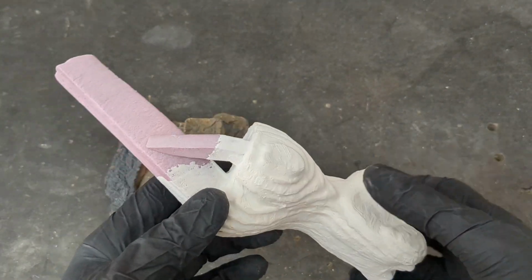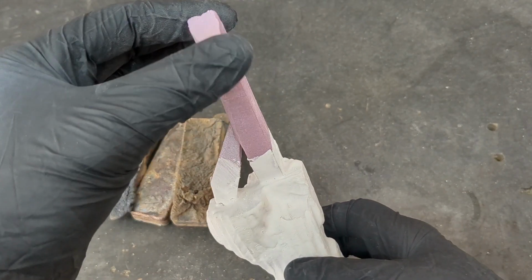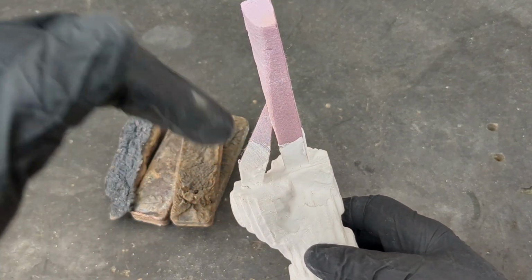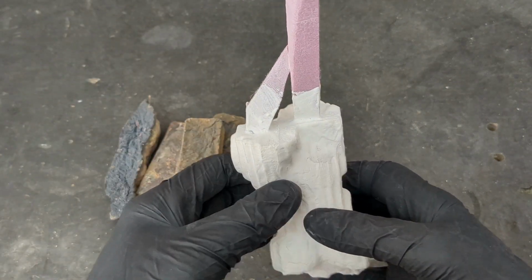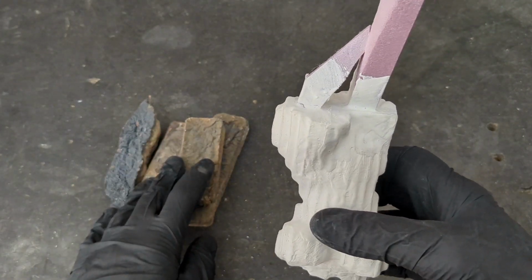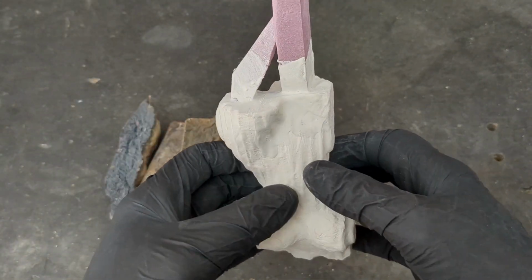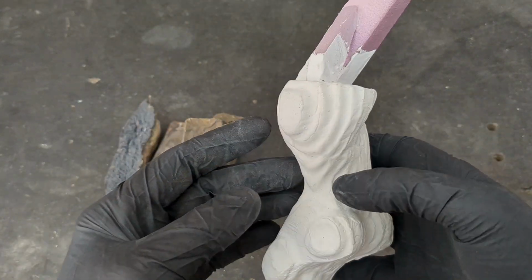Normally when I do aluminum, it's a lighter metal. So when you pour the liquid aluminum into here, this is head pressure. The more metal you have up here, it's creating head. It's head pressure pushing downward into the cast. Because I'm using heavy metal, it's going to be a lot more head pressure pushing downward, so it could potentially come out the sides into the sand.